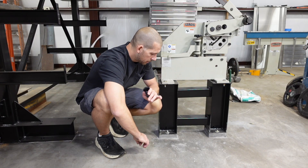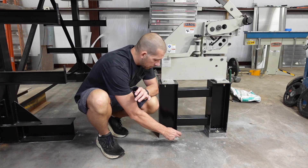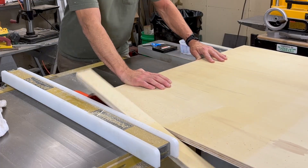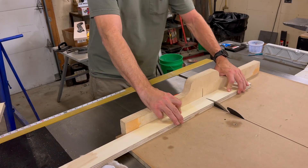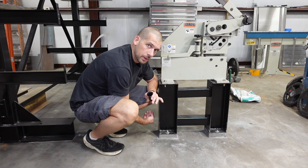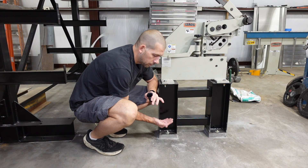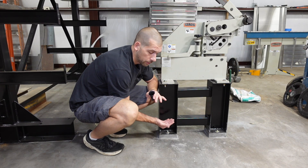What I did was make a simple little box to go around the floor plates. The point of making a box around the plate is, number one, so you can pour the grout underneath it. But number two, it'll let air come up on the sides so the grout will fill up evenly and push all the way up to the floor plate.